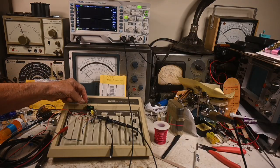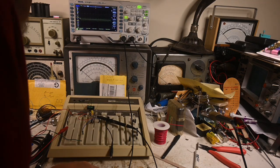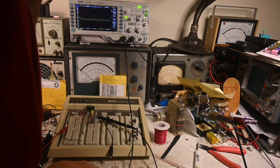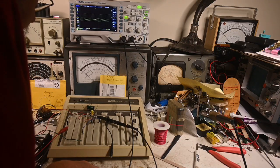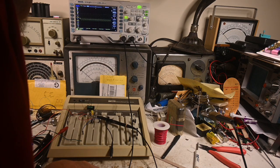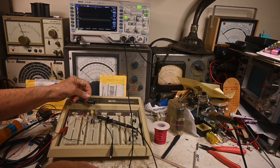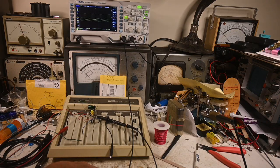Okay, we've got the third coil on. This is higher frequency, a little less output. But it's too high — this reads 2.2 megahertz, so that's over the AM band.